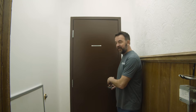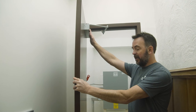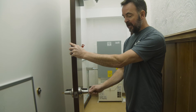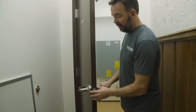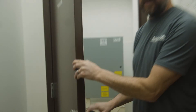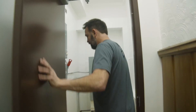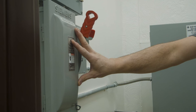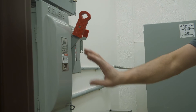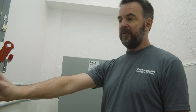A couple of important things about the machine room: the door must be fire rated, self-closing, and self-locking — you need a door closer or spring hinges, and it must be lockable with a key at all times so nobody can change it and unlock it. Inside the machine room, you would have your elevator main power disconnect and your elevator lighting disconnect. Both of these disconnects must be fused — refer to your drawings for the required sizes.